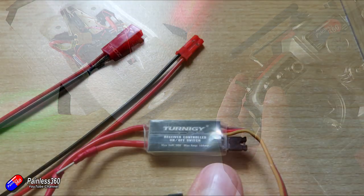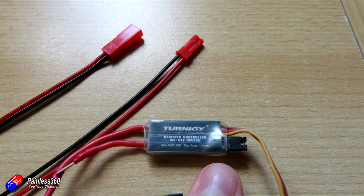The way to think of this RC control switch is it's just like a regular everyday two-position switch. If you wanted to turn on the LED lights, you'd cut the positive wire and solder each side of that positive wire to a little rocker switch. By flicking that switch on and off it would connect the LEDs to the battery and they would light. That's all this is doing — there's nothing particularly complicated about it. That means it's really versatile, small and lightweight, and relatively inexpensive.